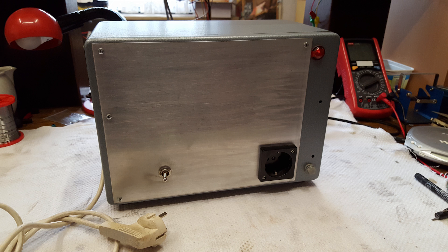Unless the device under test itself has no earth reference. The isolation transformer allows you to connect anything in the device under test to the ground of your test equipment, because the earth reference has been removed. More info can be found, for example, on Wikipedia. For these two reasons, an isolation transformer is a really nice addition to my fleet of test equipment.